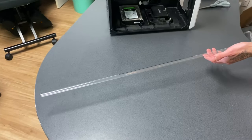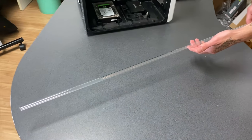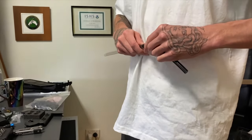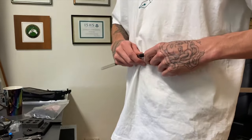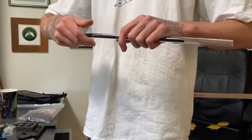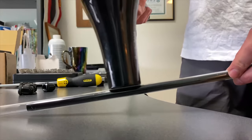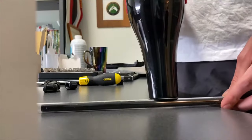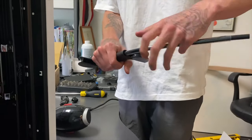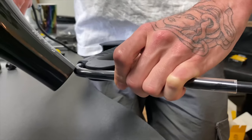Now on to the fun stuff — our tubing. I highly recommend you start with all the easy bends first and mock up all your straight lines. Take the Corsair bending core and slide it up inside the tube — don't slide it all the way in, leave enough hanging out so it can be easily removed. We're using this to stop the tube from warping while it's being heated up. Once it's warmed up, place the tube inside the bender and bend to your desired degree. After, you can take the mini hacksaw from the kit and cut off any excess material.